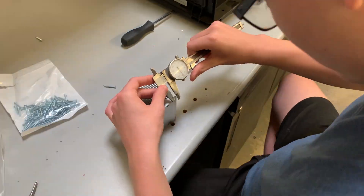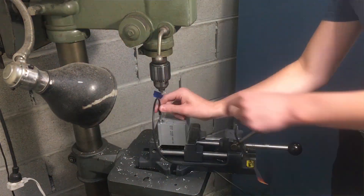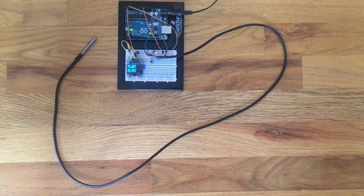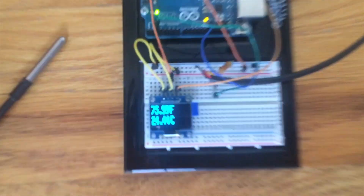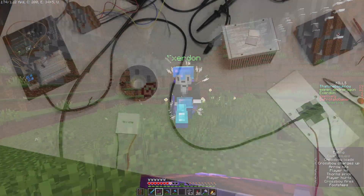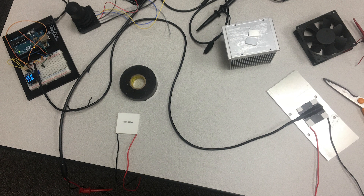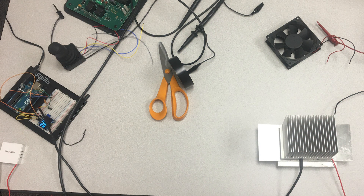Before any testing, I had to measure, tap, and drill all the mounting holes, and then measure and peck out the hole for the temperature sensor. I then drilled holes on a piece of aluminum following the same pattern. I threw together a quick circuit on an Arduino Uno that would take temperature data from a DS18B20 temperature sensor and display it in both Fahrenheit and Celsius on a 0.96-inch OLED display. I mounted the temperature sensor onto a Peltier junction and ran it at max until it hit around 253°F — nearly the max of the sensor and the Peltier junction. Running the same test with the metal standoffs and heat sink resulted in a final temperature of around 194°F — almost a 60-degree difference with and without the heat sink.